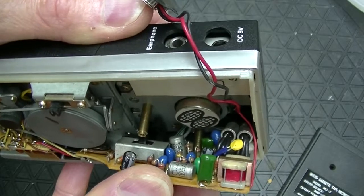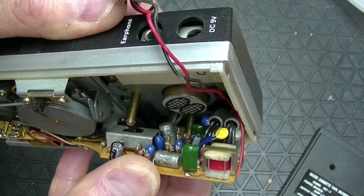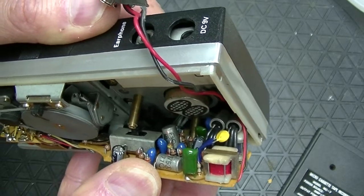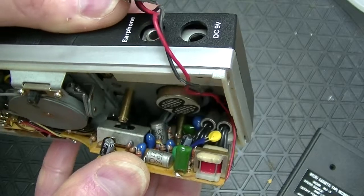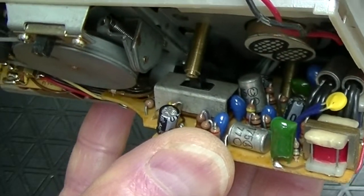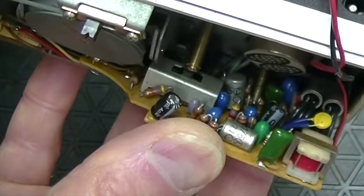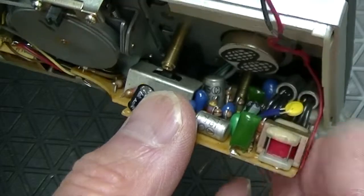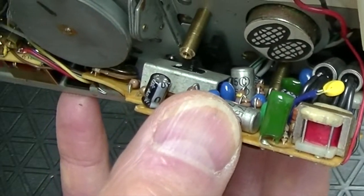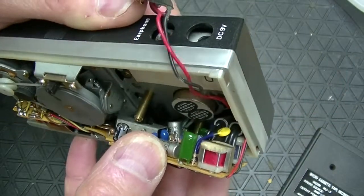What's usual is germanium transistors — that's typical for the 1960s. What's unusual is that they used tantalum capacitors, which are more expensive and slightly higher quality. I can see a thermistor in there, I guess in case the output transistors get too warm. This isn't too bad.